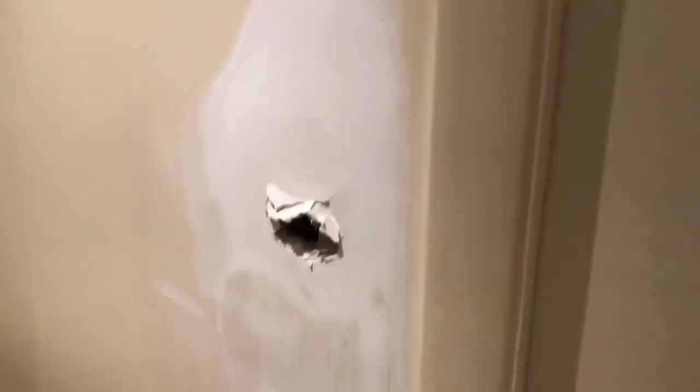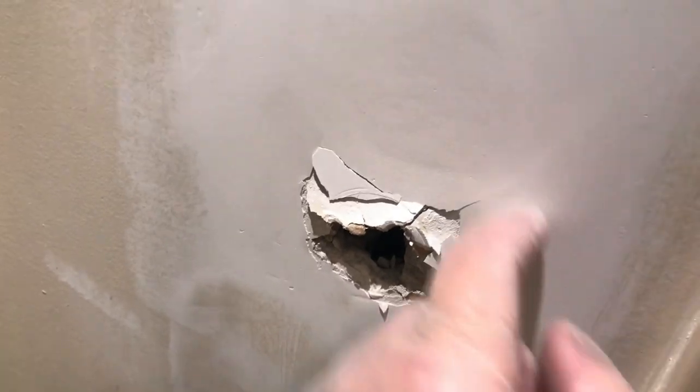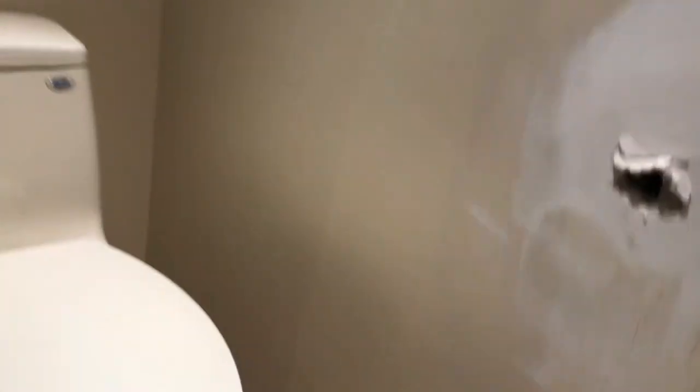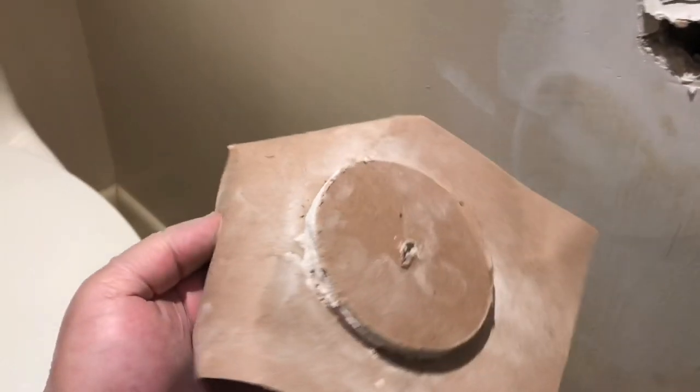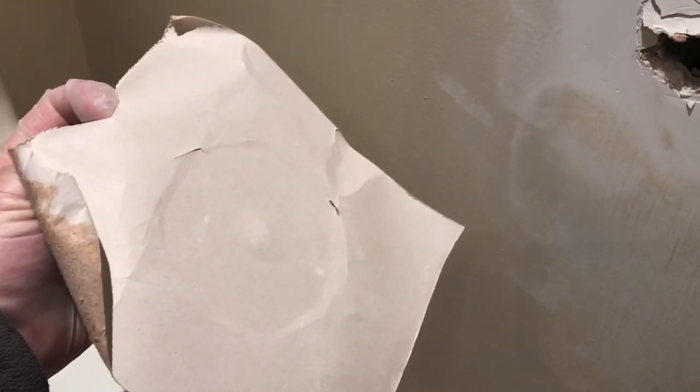What I'm going to do is get a bit, go with a four-inch cut, take this out, and put in a patch that I already pre-made. You cut the back of the drywall and leave the front paper — I'll show you how we do this when I put it on the wall.